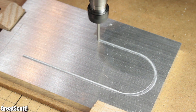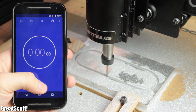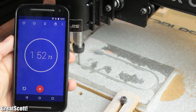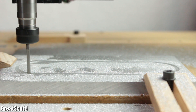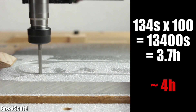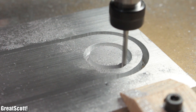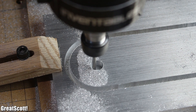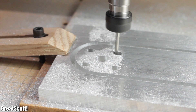Once again, drilling a dozen holes is the poor man's version of this step, which is actually faster, because each lap of the bit took 2 minutes and 14 seconds. Multiply that with the necessary 100 laps, and you know how long it took. But nevertheless, I then started the milling process for the inner cutouts, which had a slight offset in the Y-axis, but thankfully it didn't matter that much.